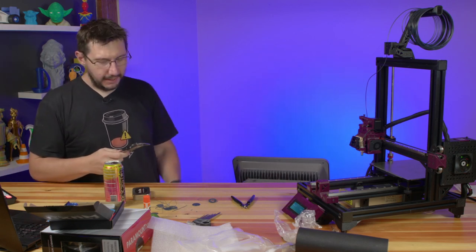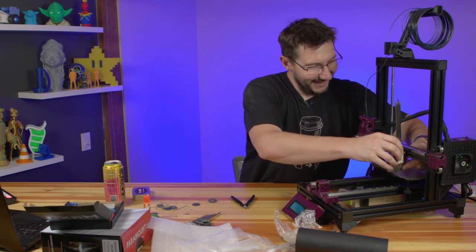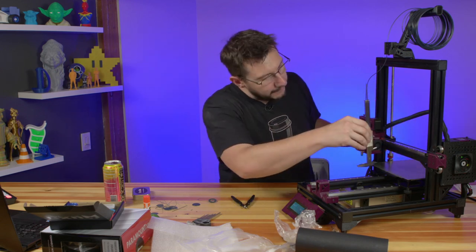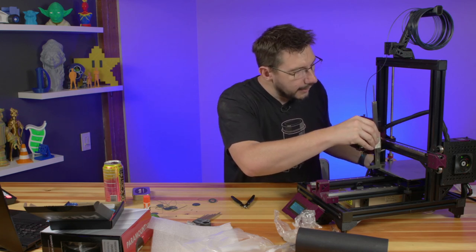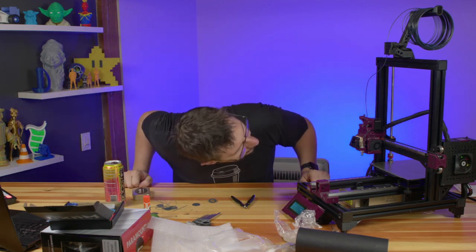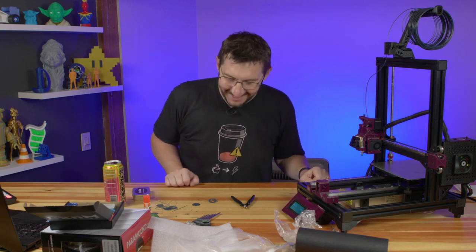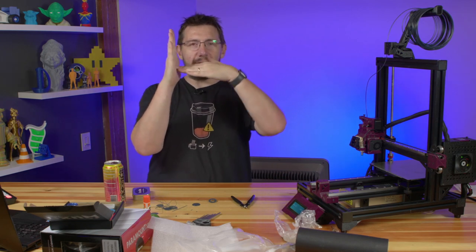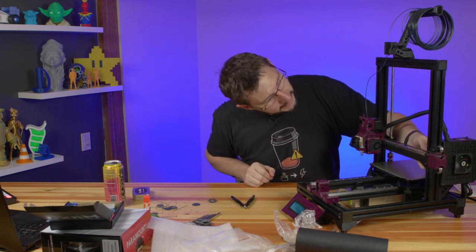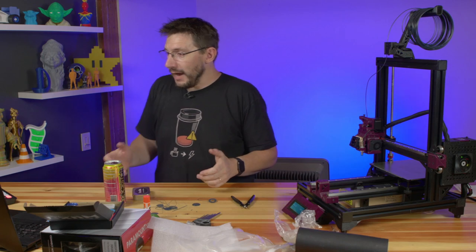I've got my calipers. We could just kind of judge the distance, right? Seems like a good thing to do. Oh boy. Okay, 55.95. Uh-huh. Okay, it won't even go on that side. So x-axis is not parallel. That's good to know. How do you get x-axis parallel when it's only attached by one side? You have to adjust the attachments here, right? Wouldn't that be how you do it? Does it matter? I don't know. I think it does.